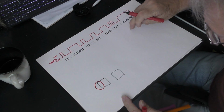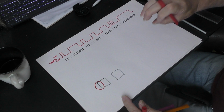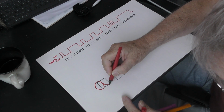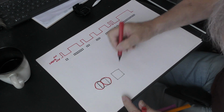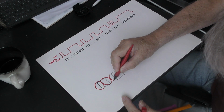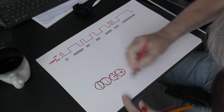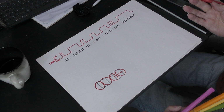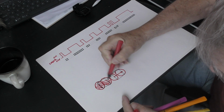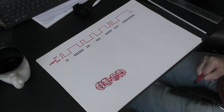It's scanning across the pixel. It knows exactly how far it's got to send the head, because remember the controller is also controlling the distance of the head away from zero. So it knows exactly where the edges of the pixels are. And when it gets to the other side of the pixel, it will say, okay, turn off. Then it jumps across this gap here, one pixel, and it says, turn on. And it turns on once it reaches that point. But of course, at that point there, we've got a beam, which is that diameter. It scans across the pixel, and then it turns off at that point. And of course, again. Now, you can see what we've done there. We've masked one pixel with a two pixel burn. So this is the size of the burn that we're going to get from our one pixel signal. And I think you can clearly see that's going to screw up the ratio of black and white in your image.